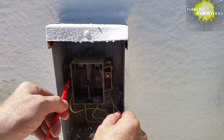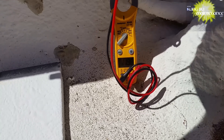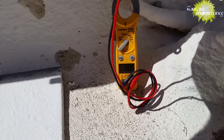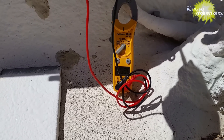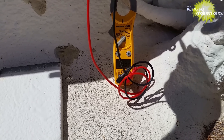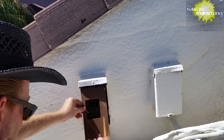If I'm going to pick which disconnect to install, I'm going to pick one that has the fuses in the portion that is pulled out. Most residential setups are 220 volts or 240 volts, so that's why I covered that here. If you're in commercial settings or something bigger, your voltage can actually be different — I didn't cover that here, but the same principle applies for testing the disconnect box.